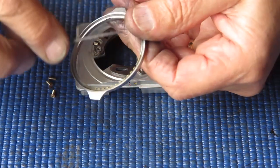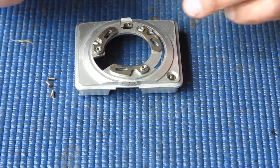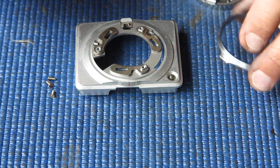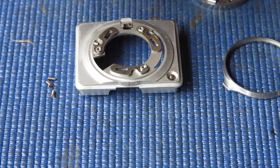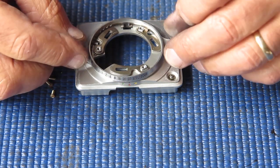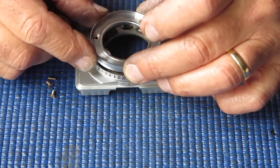Bring the mount in. Let's run some molybdenum paste around the inside edge of that - and the same there. Here's our shutter speed setting lever. I'll put a little bit of molybdenum paste right on the peak of that, and some on this catch - that's the catch that unlocks the ring. So our shutter speed setting lever goes there so that the numbers are at the top, obviously. This piece drops in here.